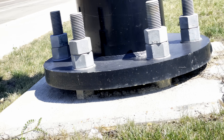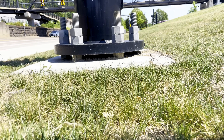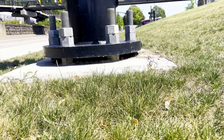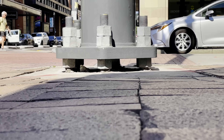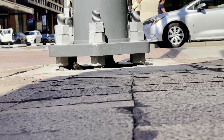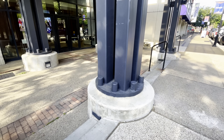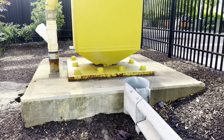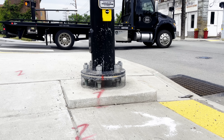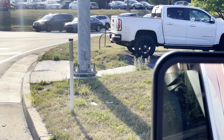In fact, there are a lot of cases where that extra step is worth skipping. You can design anchor bolts strong enough to withstand all the forces a column will apply, including compressive forces downward. And you can design a base plate stiff enough that forces don't have to be distributed evenly across the entire area. If you do, you have a standoff base plate — it just floats above the concrete with only the anchors in between. It looks like a counterintuitive design; we think of a base plate as a shoe that should be sitting on the ground. But for other structures, a base plate is really just a way to connect a foundation to a column through an anchor. If you pay attention, you'll see these standoff base plates everywhere.